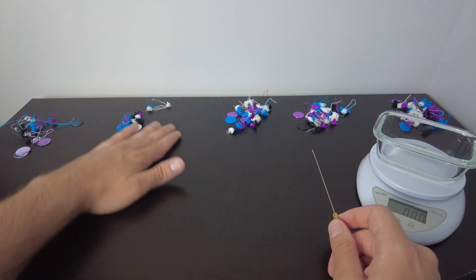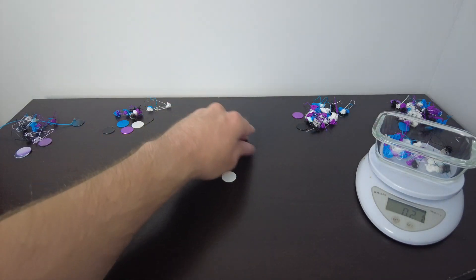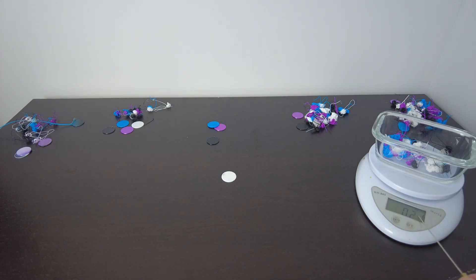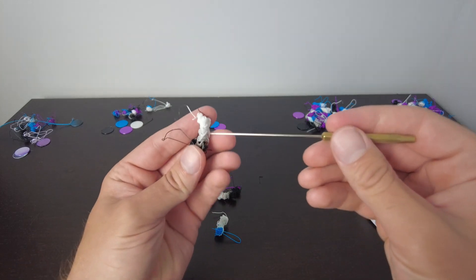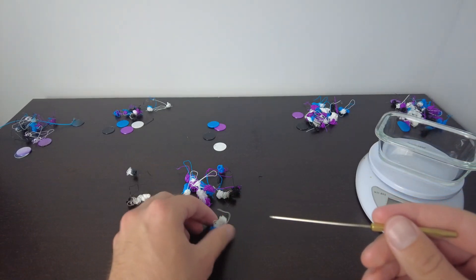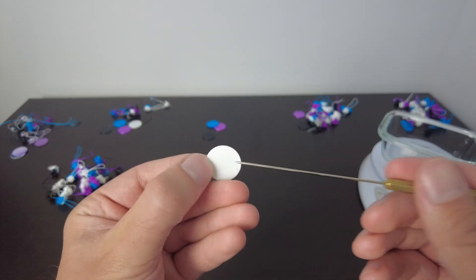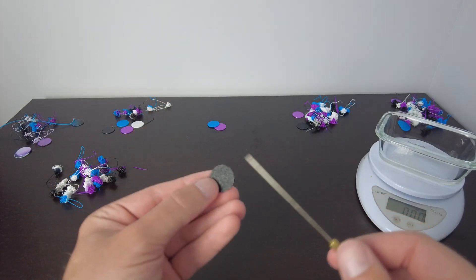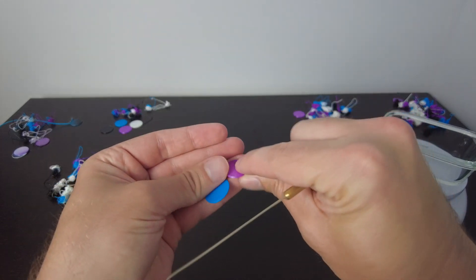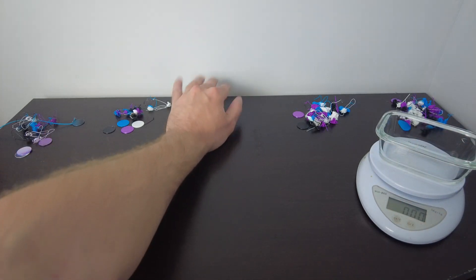I'm pretty impressed with the 0.5. Now moving to the 1.0, the default — dropping in all the poops, it looks like 0.21 ounces. So that is three times the amount that 0.5 had. With the 1.0 multiplier you really see the transition from one color to the other — black to white, white to blue, all of them. No surprise, our prints look good. There was a small defect but I don't think that's from bleeding. The other discs look fantastic — there's no bleeding at all. Not even the little ring we had on the black before. Looks fantastic, discs are good, no problem.